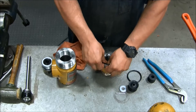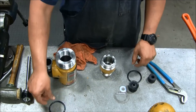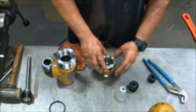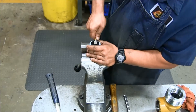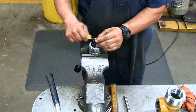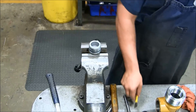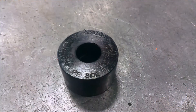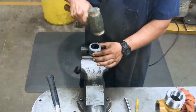Remove and discard the liner sub o-ring and replace it with a new o-ring from the rebuild kit. Next, remove the stem cushion from the bonnet and replace with a new stem cushion from the repair kit. Note: the stem cushion should not be removed unless it is going to be replaced, as removal will likely damage the stem cushion. Additionally, care should be given to ensure the replacement cushion is oriented correctly so that the pressure side marking on the cushion faces away from the bonnet.